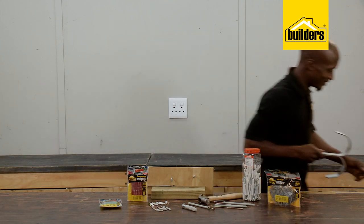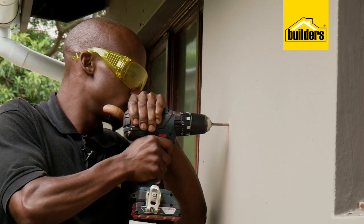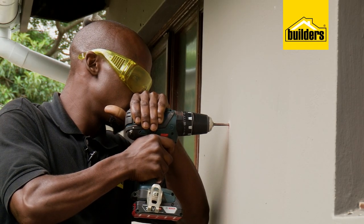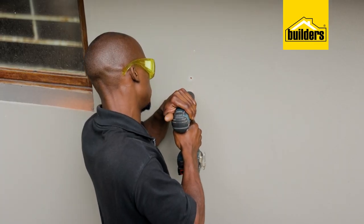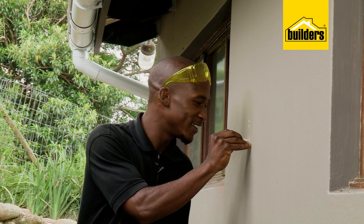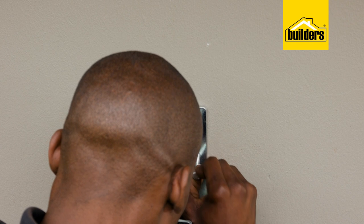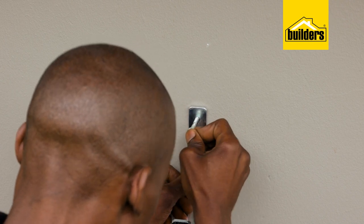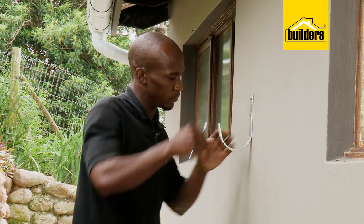Let's go mount these two brackets. So I'm installing this bracket using screw-in anchors, so I need to drill my hole 6 millimeters by 60 millimeters. A handy hint here to get the correct depth is to use a piece of masking tape on your drill bit as a depth guide. Holes drilled, I can now push the plug in — sometimes you need to give it a gentle tap with a hammer. Now I can put the screw into the hole in the bracket and into the plug before tightening it up. There we are — the bracket sits tight.